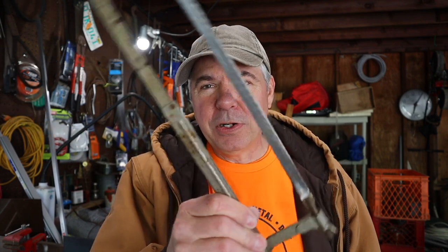Let me share a couple tips. We've all probably got one of these cheap little hacksaws lying around — first tip: invest in a good hacksaw. If you're going to use it more than a few times in your life, get a good one, because these cheap ones flex and are kind of a pain. I got one with a nice solid frame and it really makes a big difference. The key tip when using a hacksaw — or any hand saw — is to let the saw do the work. You barely put any pressure on it at all. Once you get it started, it's just the weight of the saw and the weight of your hand. If you put too much pressure the saw will bind and make a crooked cut. Let the blade do the work and be patient.